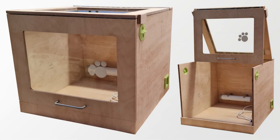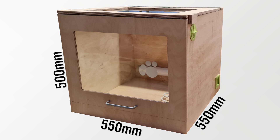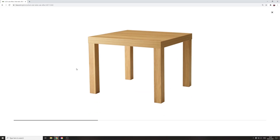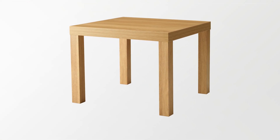Here it is. Made from 12mm birch ply so that it was not too heavy, the overall footprint is 550 x 550mm and 500mm tall — about 21.6 inches square by 20 inches tall. The reason for the choice is that many Prusa owners have made enclosures out of an IKEA coffee table called a LACK, and the top was 550mm square so I knew it would fit the printer fine.